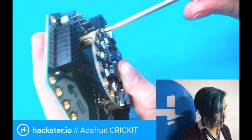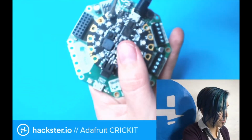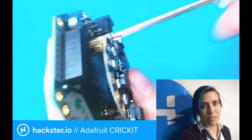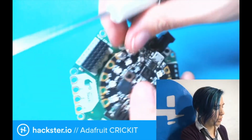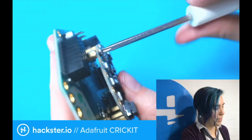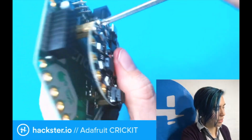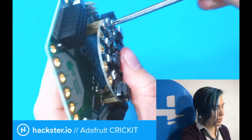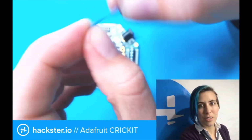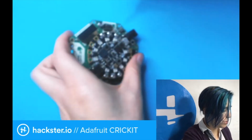You could also, given this format, look, you could still screw some wires in between there, which I really like as a method of connecting wires to stuff. It depends on what type of hookup wire you're using, you know? If you're using solid core hookup wire, then it can be a really nice way to create temporary connections. Although I would definitely go with Adafruit's silicone-coated wire, because this stuff is really flexible and really durable. I think it would do the job if you tinned it.